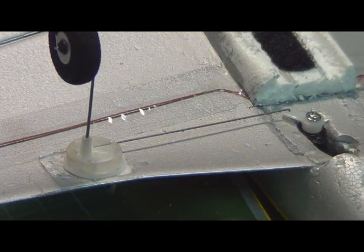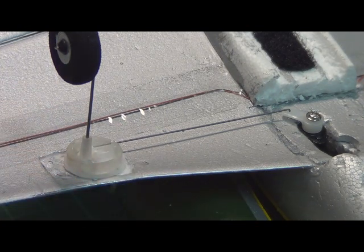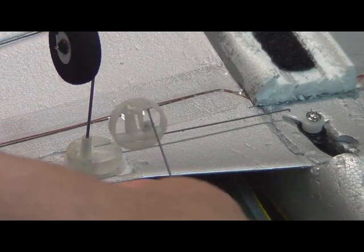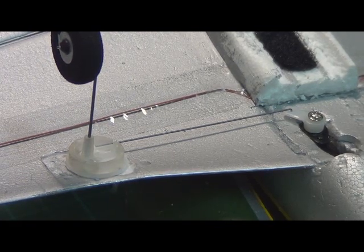Right now I'm working with just one — I've exploded all my other button retracts. Here's another one I broke, and here's another one just flopping around. I kept testing them until they failed, to find where the weak spots were. By doing those tests I did reveal a couple more weak spots, which I've taken care of in the 3D model now, strengthening a couple of end points. So it was worthwhile.